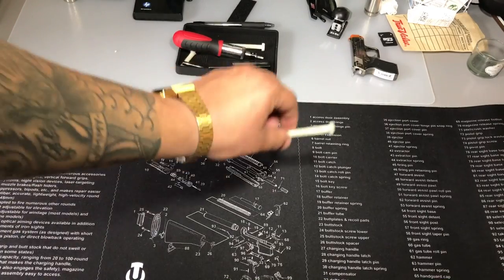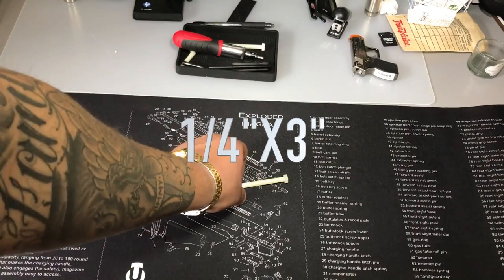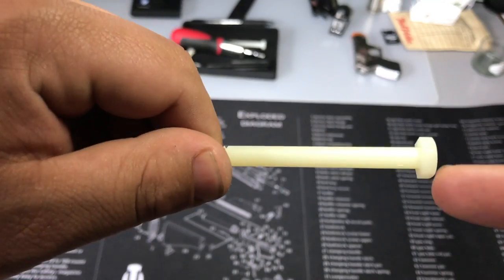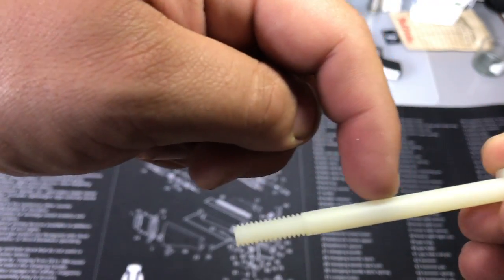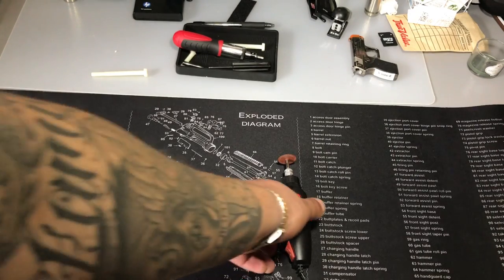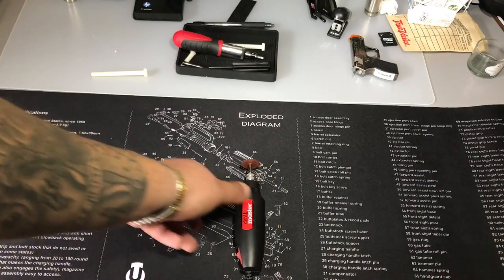You will need your nylon bolt. Once again, that bolt size is 1/4 inch by 3 inches long, hex style, with the threads not all the way through the bolt itself. We're going to end up cutting the head of this bolt off and measuring down one and one-quarter inch down the shaft of the bolt — that will be our new buffer pin. For this video I'll be using a cheap Harbor Freight Dremel-style tool with a cutoff disc to take the head off the bolt and cut it down to size.